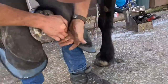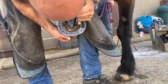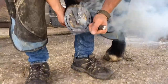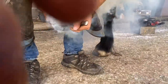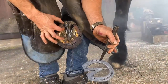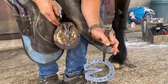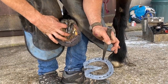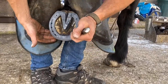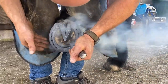And then fit it up. Good boy. Plenty of heat in this. So, looking at where my toe is, to fit my toe first, you know, principles of horseshoeing. But what I mean is when you've got this really hooky heel, so actually to fit that and cover it, if you were shoeing it with a normal shoe, you'd just about want a reverse heel on it. So actually, if you look at my heart bar, it's like a reverse heel heart bar. So I get a lot of cover there, which is what I want. So I really like that.